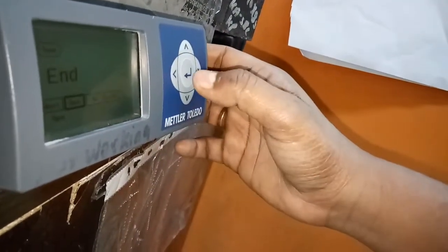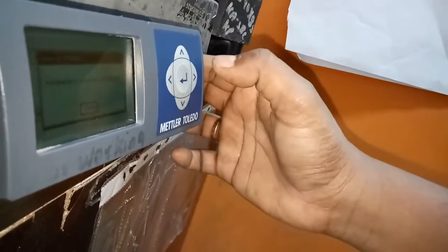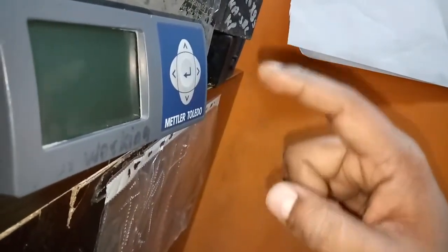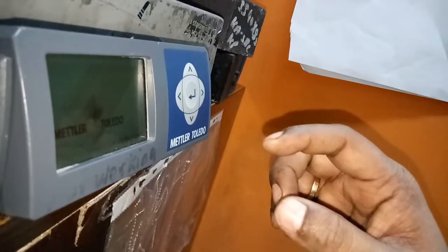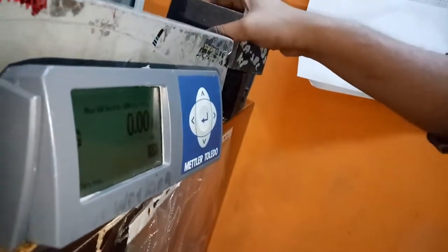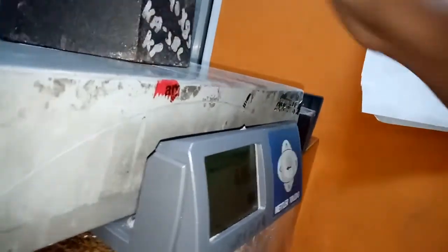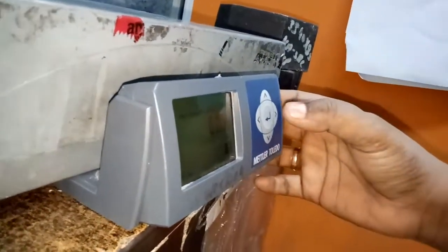Select that save button using the right button and click the enter button, then it will take the parameter save and update. Okay, then enter. It's restarting and showing the normal display again. So all the setup is done. One time you can cross check the weight also. It's showing 5 kg. So everything is completed. Thanks for watching.